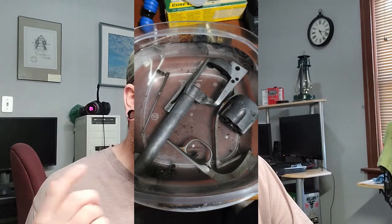The first one went in the bath for two hours and it just peels the finish right off. Some people might suggest plugging both ends of the barrel before putting it in the bath if you're not comfortable with it, but I decided to leave it in. It actually cleaned out a lot of stuff inside that you typically can't clean with your rods. After taking it out I ran a couple of patches through after neutralizing with baking soda to stop the vinegar, and I pulled out so much crud from inside that barrel.